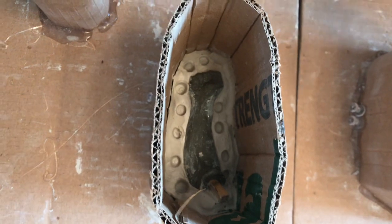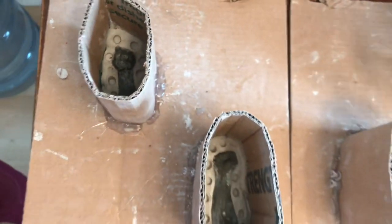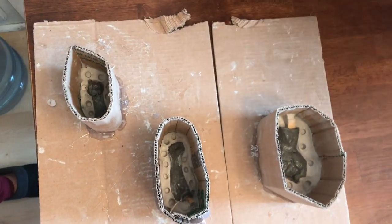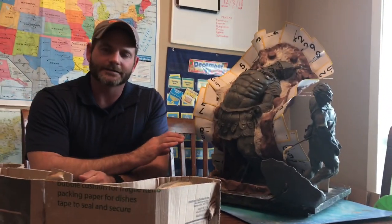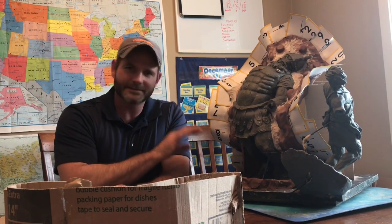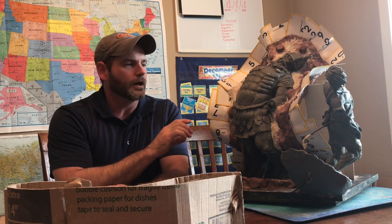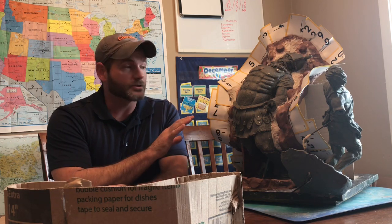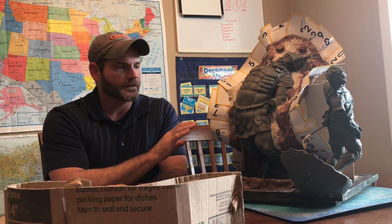These are a little bit easier because they're smaller. We'll fill these with silicone, turn them over and do the same thing on the other side. Basically the prep mold process is the most difficult for people because if you mess up on this process and you don't focus, you can really mess your sculpture up and have an unsuccessful mold. So take your time.